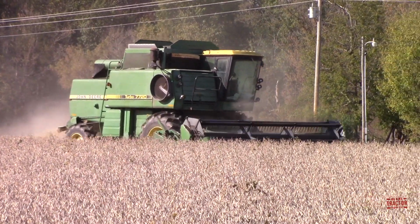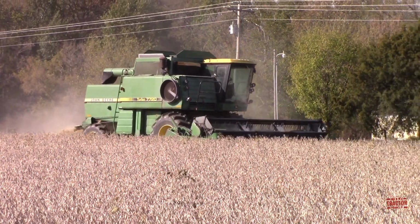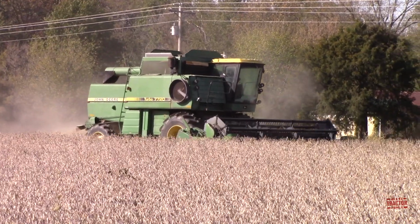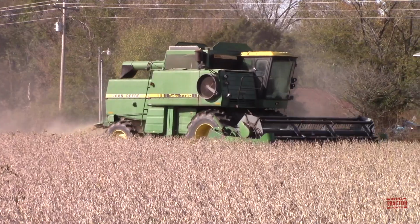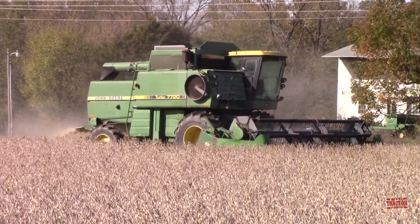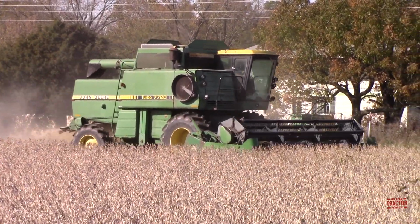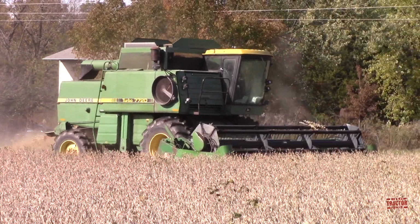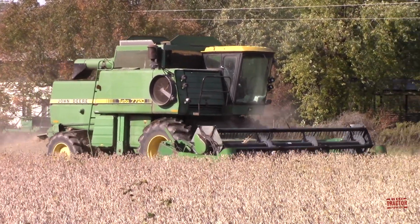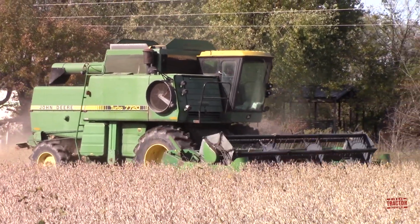that was originally priced at $10,450 when it was new. The 7720 Turbo Combine features 5 straw walkers for grain separation. It is equipped with a 190-bushel grain tank and could be ordered with a 14-foot or 17-foot unloading auger that unloads grain at 1.9 bushels per second and is fitted with a 100-gallon diesel fuel tank.